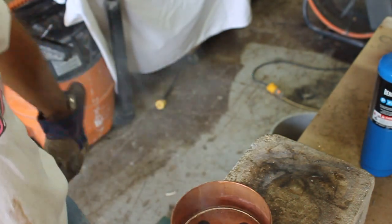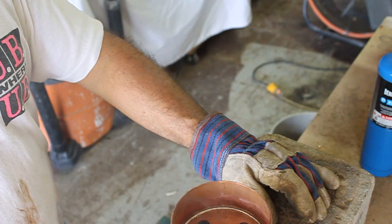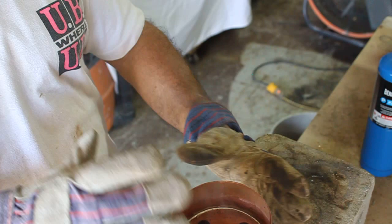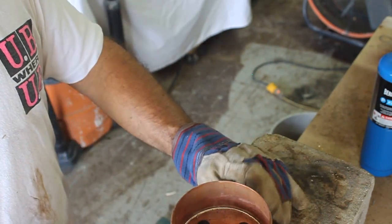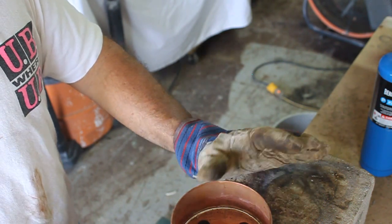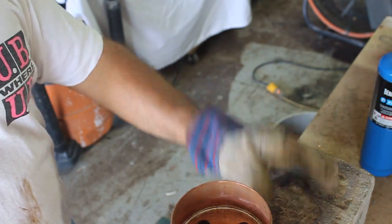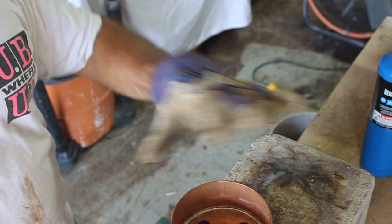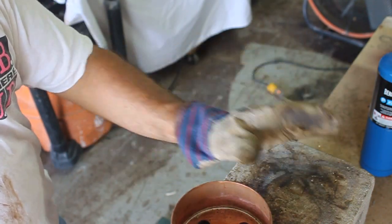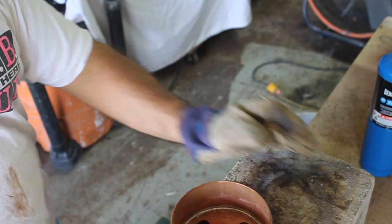That's that portion of it. You've just locked in that component so that once I drill my holes out here, water will be able to go inside and surround all those pipes and cool them off. When that ethanol goes through there, it's actually condensed and drops back down to load those plates. I'm going to let that cool for a second, drop it in some water, flip it over, put that second ferrule on there, and that'll finish up the hard stuff.